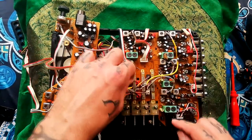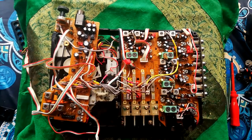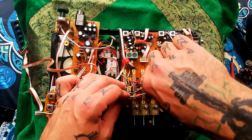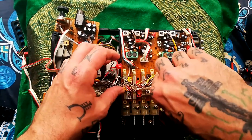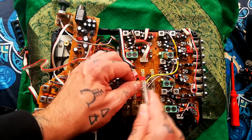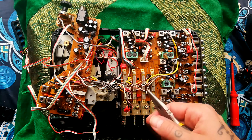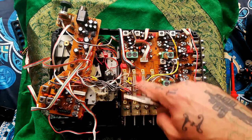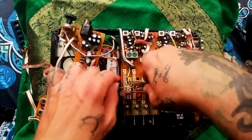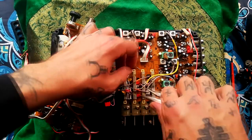One thing I'd note about removing these is there's color coding, but there are two red connectors here that look identical. I'll definitely need needle nose pliers for those. When I unplugged these first I didn't notice the two little red ones — so when you come to open this, make sure you make a physical note of what goes where. I'd consider marking one side with a black Sharpie and putting a mark on the PCB. As it stands, I'll reassemble it after cleaning, and if it's still working, I'll reopen it and swap those cables around to see if that fixes the problem. The other cables are color-matched — yellow connector to yellow header — and they have different numbers of pins, so there's no real way to mix those up.